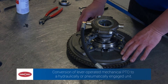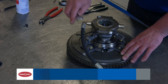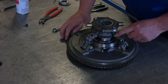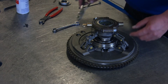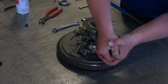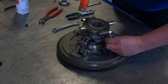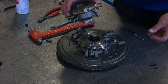Next, we're going to convert the SP-111 clutch pack over to the air operated version. We'll start by removing the grease hose from the sliding sleeve assembly, and then we will remove the upper cotter keys and cotter pins from the clutch pack, first collapsing them down and then taking a small punch and tapping them out. That's the sliding sleeve assembly removed from the clutch pack.